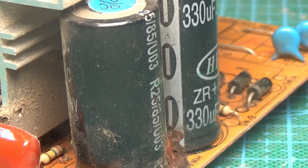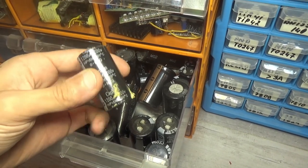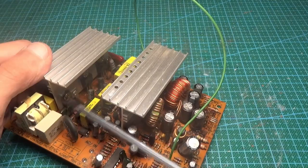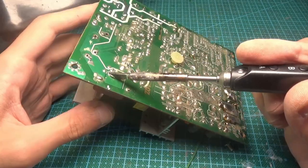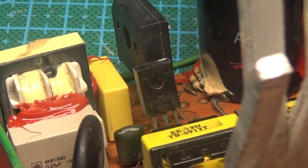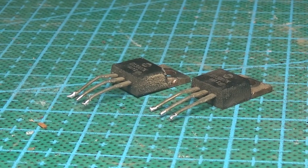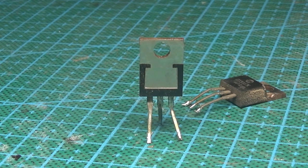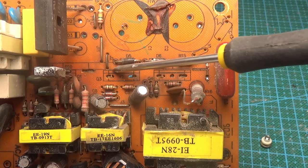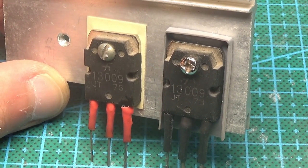The electrolytic capacitors of the half-bridge were originally 200 volts. I will replace them with 1200 microfarad capacitors — enough for units up to 1 kW, with a large capacity reserve. Then we unscrew the power transistors from the radiator and dismantle both the radiator and the transistors. There is another transistor on this radiator for the standby source — I may replace it too. Transistors in such sources are usually high-voltage NPN from the MJE line, in this case MJE13007 in a TO220 package. Looking at the board, the seat allows installing transistors in a larger case such as TO247, and therefore I found a pair of MJE13009 to install.